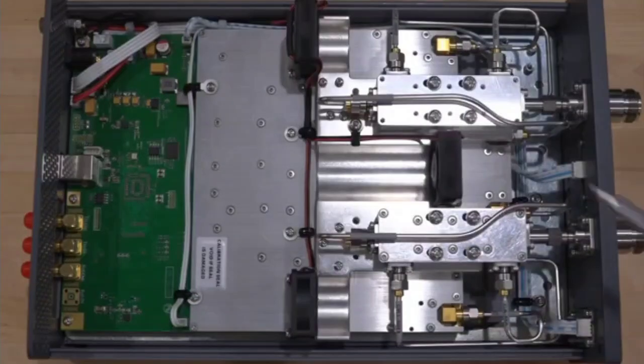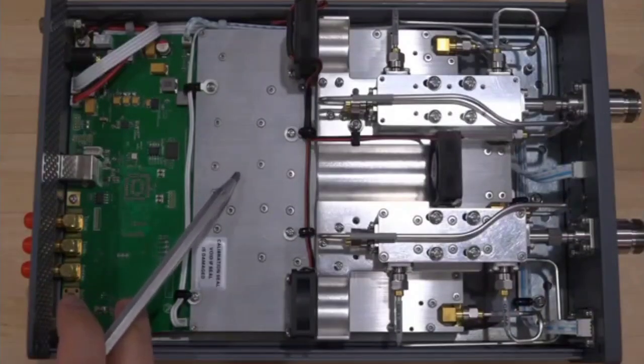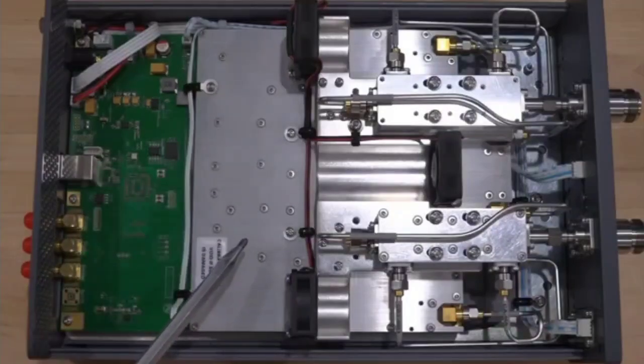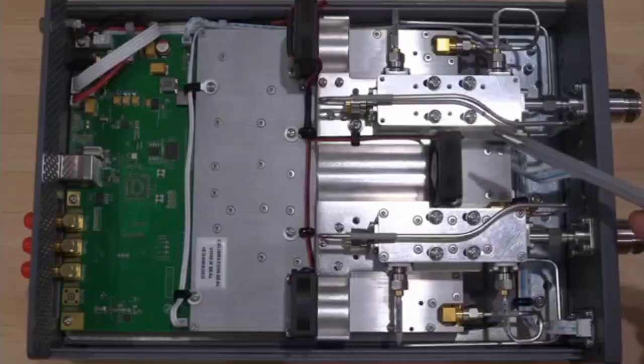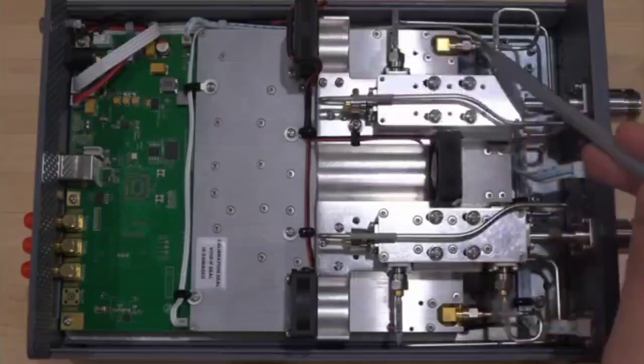Now what this does is that it allows you to get much better isolation from the PCB itself. One of the problems with making a single PCB network analyzer is just a simple isolation between the two ports, and therefore the lowest level of coupling you can ever measure. In this situation, bringing this all out of that board and having their own mechanical chassis and aluminum body around them separates them. So if you look, each of these has 1, 2, 3 ports here.